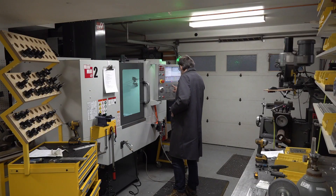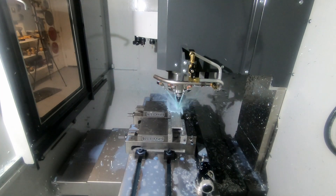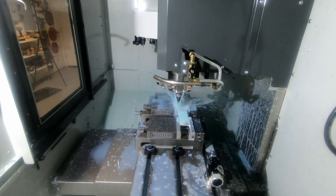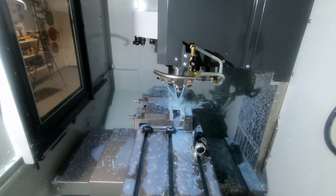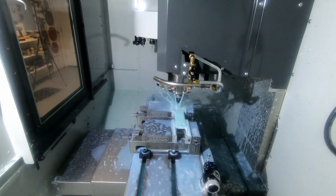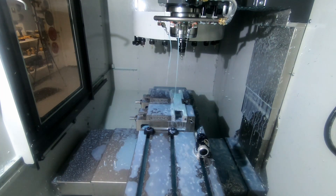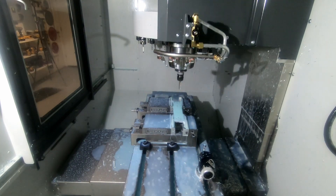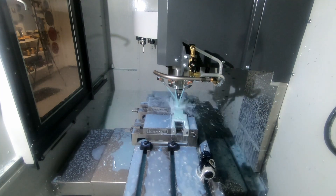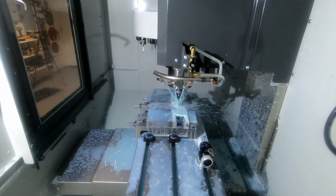100% rapid, no reason to slow down or stop — poking some holes using the recommended feeds and speeds provided by the CAD program: 508 surface feet per minute, which results in almost 10,000 RPM for that little guy. I'm glad I got the 10,000 RPM spindle — it really makes a lot of things work better. My new improved toolpath and feeds and speeds are resulting in very little, if any, buildup of stringy chips on the tools. I'm getting very good chip clearance. This one is also 508 surface feet per minute at around 5,770 RPM.